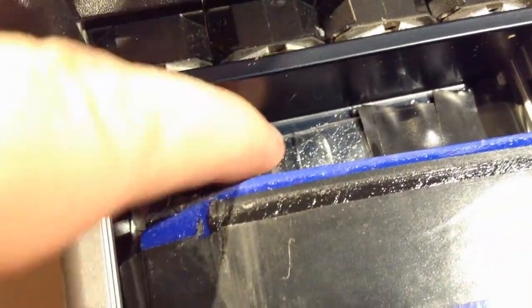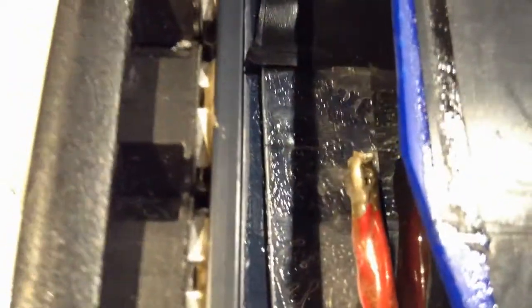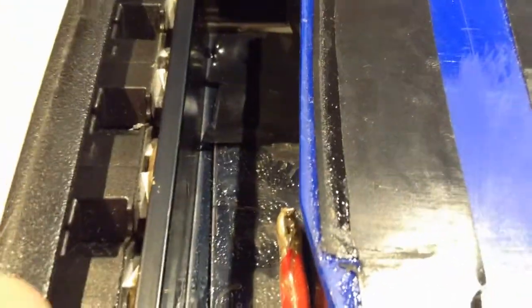So this goes down and then this way, underneath the battery. And I have a little plastic spacer glued between the battery and the heatsink, such that the heat won't go into the battery, but out on this fin. So this L profile is screwed tight here, so I'm sorry.